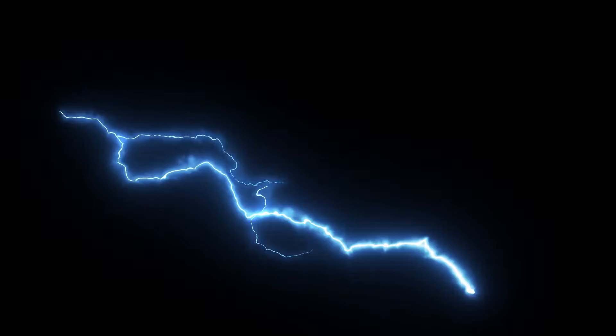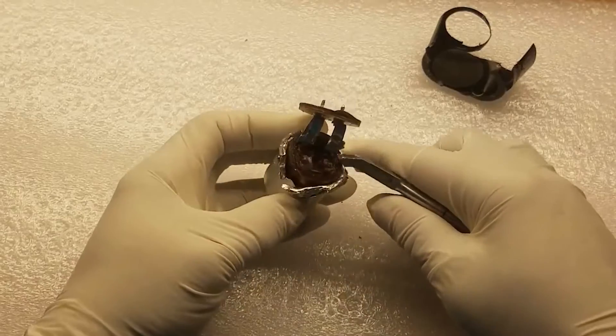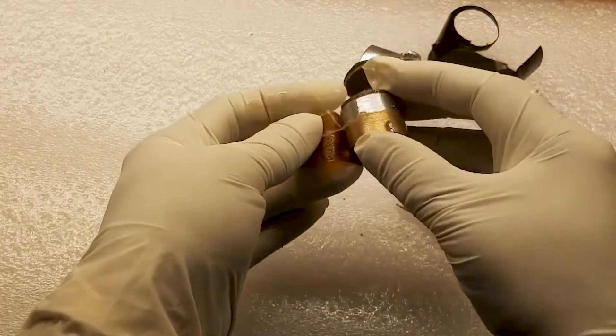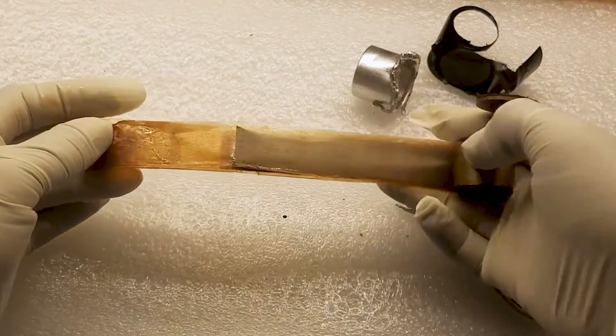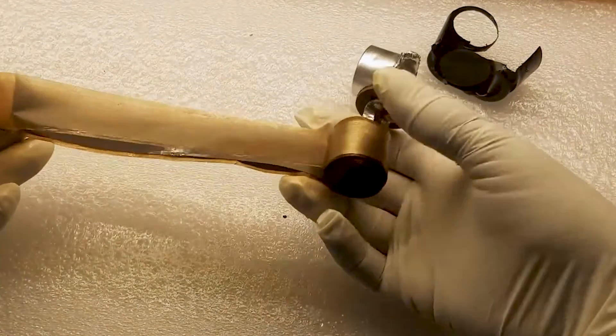Other things like heat, voltage spikes and usage further reduce the lifespan of these components. Taking apart a real life example of an electrolytic capacitor, we can see the inside is made of metal films with the dielectric material in the middle. The two metal films are very close to each other and the dielectric material is not a perfect isolator, so there's a voltage limit. Exceeding this voltage can create a spark and destroy the capacitor.